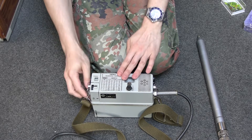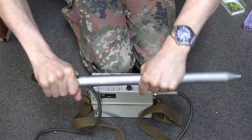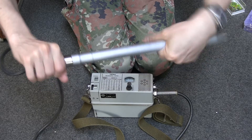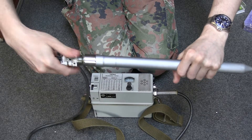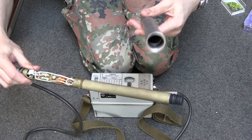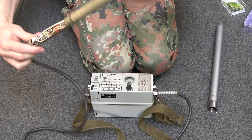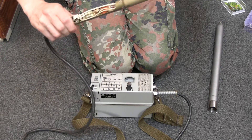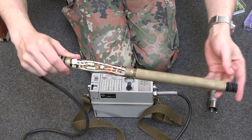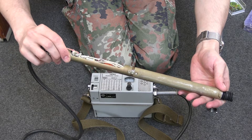As I said, it's not as sensitive as it should be. I'm just going to flick this off and then open up the probe so you can have a quick look at what's inside. It's pretty straightforward, but I've not taken the probe fully apart yet because it's quite fragile feeling compared to a lot of Soviet gear. If we unscrew all that, we should be able to pull this out. There's nothing else in the probe — that's an empty metal pole now. I think the photomultiplier from forum pictures is basically in that section, like the little crystal section that sits there. Maybe the crystal's missing, which would explain why it wouldn't be very sensitive — or would it just not function at all without a crystal? There's some of the electronics. This bit is where the photomultiplier is, and the crystal basically sits right at the end. That's how this big wand works.